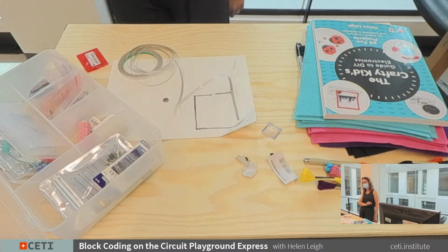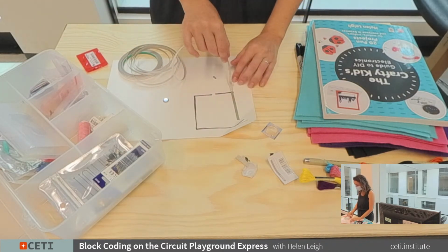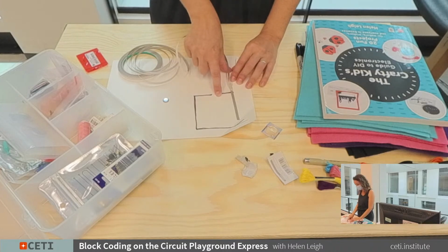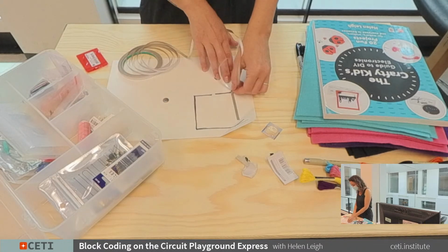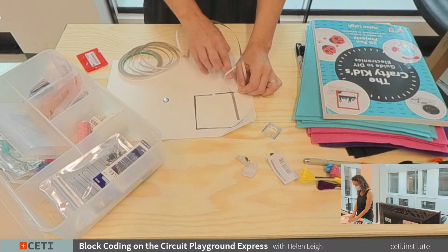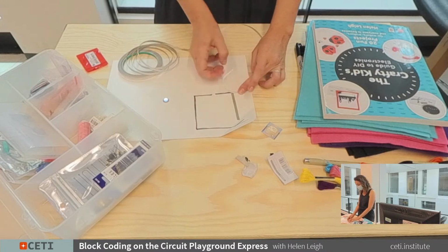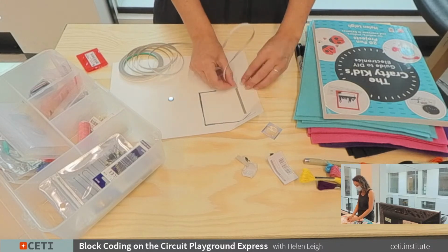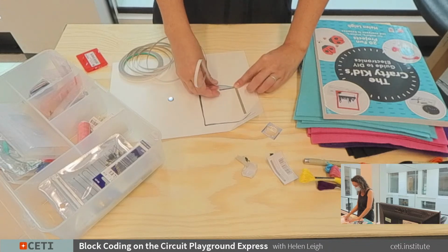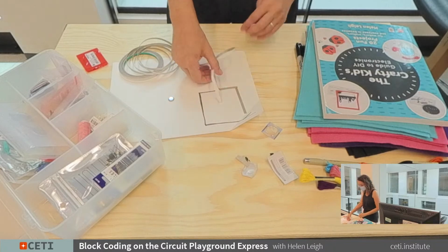And then when you get to the corner, pay attention for the corner bit, I'll show you a couple of times. If you want to turn, so I want to go down this way. In order to go down this way neatly, what I do is I pull the whole tape in the opposite direction, like this, and push it down. Then I've got a little right angle here that's going in the opposite direction to where I want it to go. And once it's pushed down, you push it back again, so it makes a neat fold, like that.